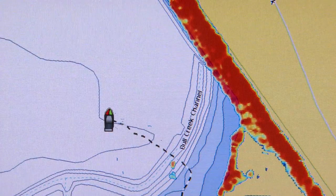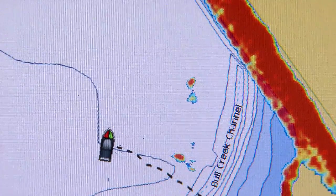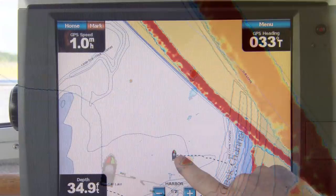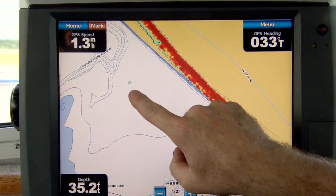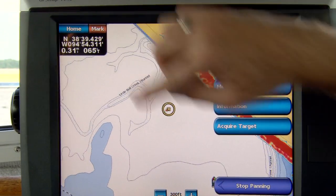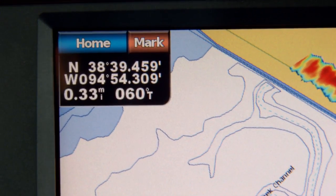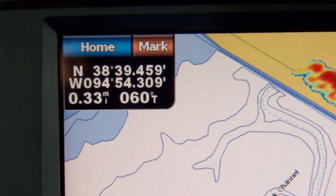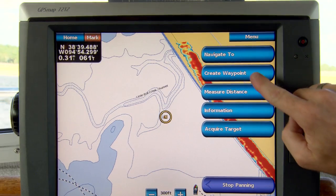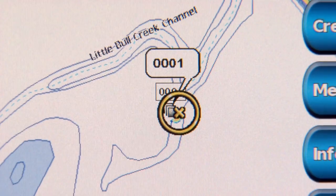The radar chart overlay option is worth mentioning again — overlaying radar data onto the chart plotter screen may help you determine whether a radar target is a buoy or a boat. If you're out on the water and see a radar target and want to know how far away it is, simply move your cursor over the target, or with a touch screen, just touch the target. A data box pops up showing the target's lat/long, and its distance and bearing from you. You can also create a waypoint right at that radar return location, which will be stored in your library for future use.